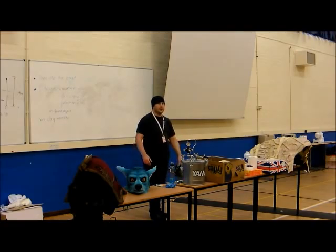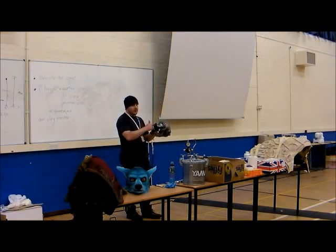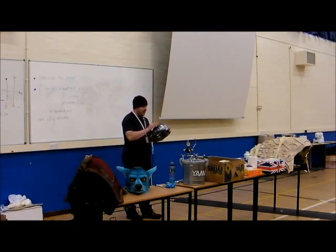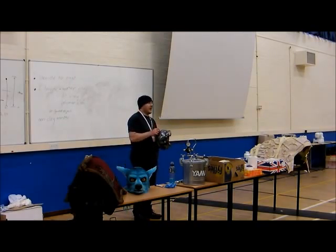Yeah. You said you wouldn't clean up your master mould. Wouldn't you want the master cast? Your master cast. Yeah. Wouldn't you want your master cast to be perfect so you can recast? Well, when I say clean up, I mean cutting all the edges off like this and cutting all the holes. Say if you've got, this has got a lot of air dimples in, because like I said, I was only testing this one, I was only testing the finish and things like that. If you've got air holes, yeah, get in there with a little bit of filler. You can use a bit of Milliput, whatever, clean it up, file it down.